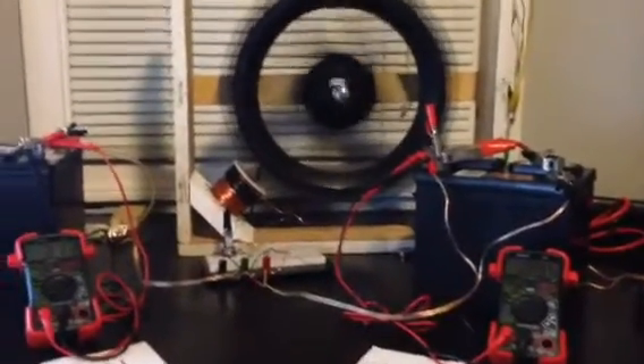One of the things I did here to squeeze some extra juice out of this bad boy was take another coil. The second coil is not set up with a Bedini circuit — it runs to a bridge rectifier, a little Radio Shack job, 50 volts, 4 amps. If you don't know how to hook up a bridge rectifier, it's very simple: there's always a plus peg, the plus is always identified, there are 2 with the squiggly line representing AC, and the only one left over is DC negative.